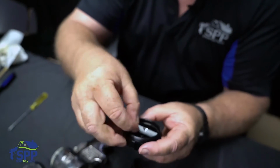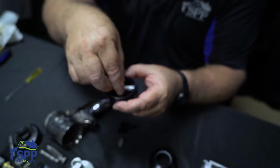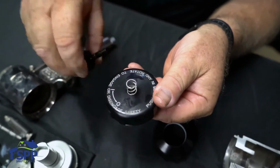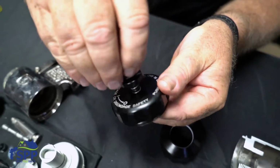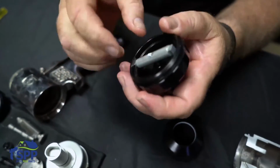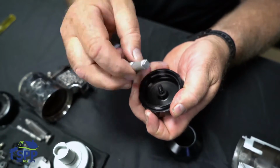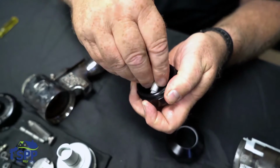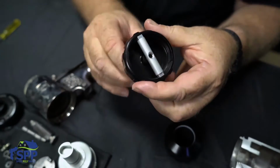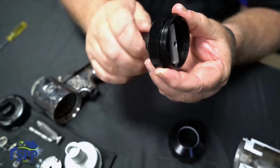Assembly is very easy. Just put it in these screws right here. Go ahead and from the other side, put your spring in, and then push your safety down through it and just start it. Here's where you'd want to apply the blue Loctite. Once you get it pushed through like that, put the blue Loctite on and then start it. And then center it in the little square cutouts and then finish turning it till it's tight.